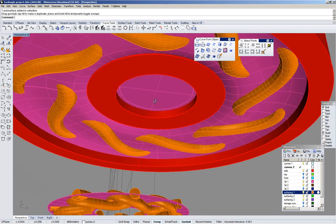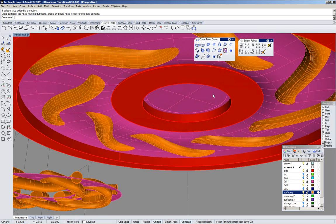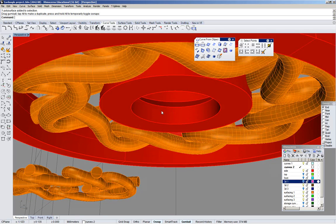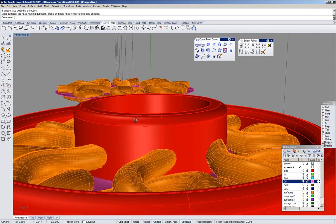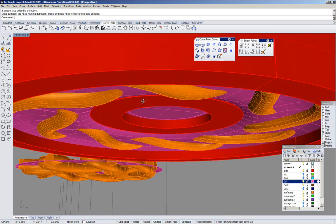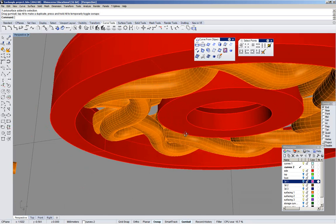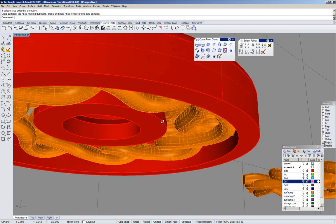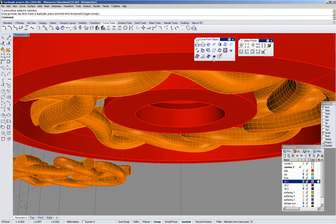There are two considerations here if I'm going to do this. One consideration is that I don't go so far that I am above the wires. It has to stop at least where that wire is, which it does. The other consideration is this thickness on the bottom. I have 7/10 there. I know that because I engineered it in. I really don't want to go less than 5/10 for this thickness. So I'd like to know what this length is right now. It should be 7/10.